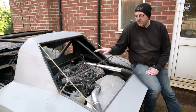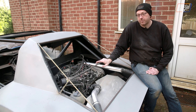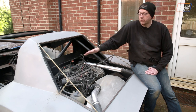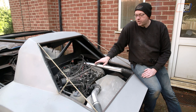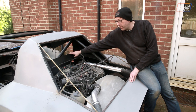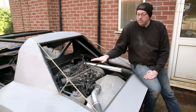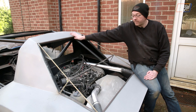It might run through depending on how long we put the window in, but the middle of this really needs to be quite strong so it's going to have to go in. I also noticed there's a cross beam through the middle because these side pieces really wanted to flex inward. I've put it as low as I possibly can — it's probably about 60% of the way down, 40% up — so where it's wider it should give good strength. It's also roughly in line with the bottom edge of the window, so once we get the rubber trim holding the window in, it should lift it up and sit across the top.